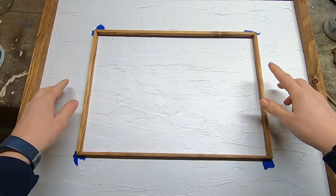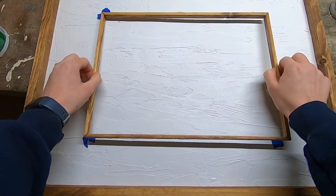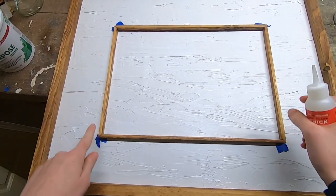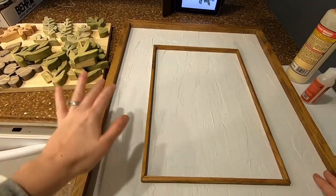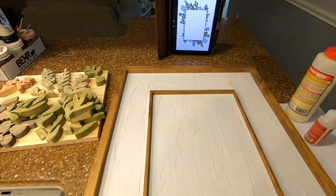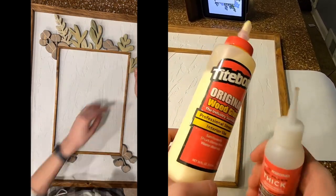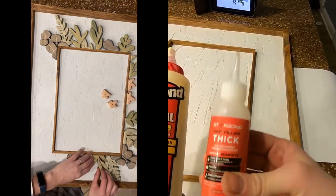When it comes to the glue-up, I'm going to start with the inner frame first. I went ahead and just loosely put this together with some super glue and wood glue, let it dry so I could place it, find the center, and marked it with painter's tape. Now I'm going to super glue it down, and once it's down I'll reinforce it with some nails. Then we can do all the outer pieces. I'm going to glue them all down using a combination of my Titebond wood glue and Starbond super glue. The wood glue is better for a long-term hold; the super glue is really good for securing it for the time being and acts like a clamp to the pieces.